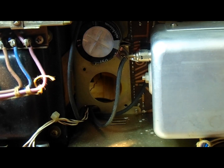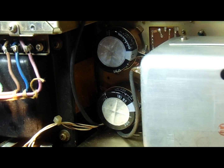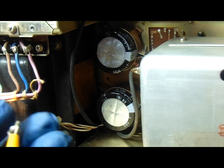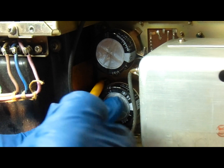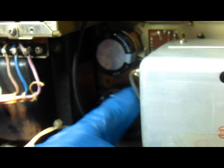I've got the first cap in. Let me spin the radio around to make sure I'm putting the second one in the right direction for the leads — I need the negative oriented the same way. I'll slip it up in there, make sure no wires are trapped underneath, then get my two screws out. This screw holder is a handy little tool for reaching into tight spots — I prefer it over a magnetized screwdriver because it gets a nice grip and doesn't turn loose if you bump it.